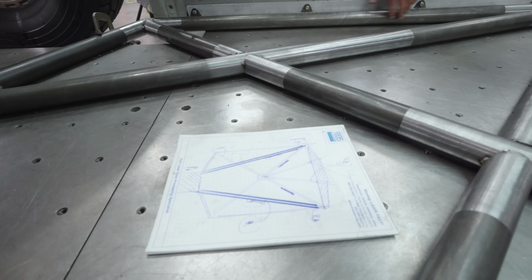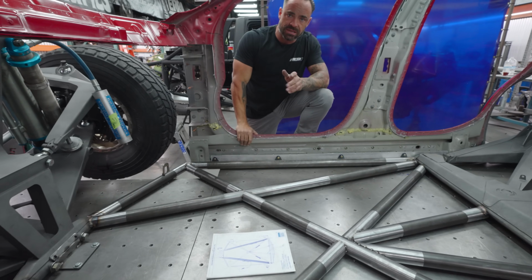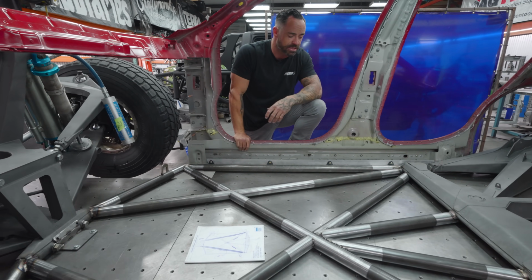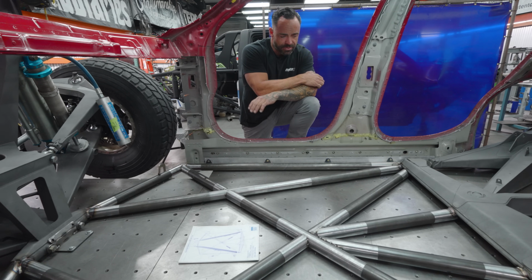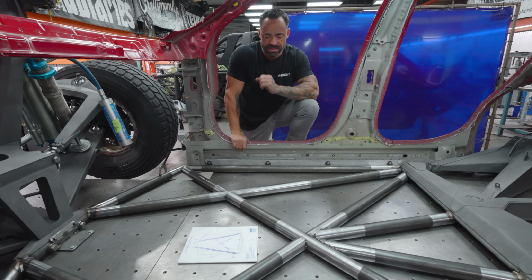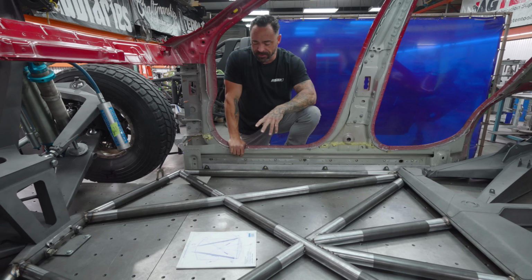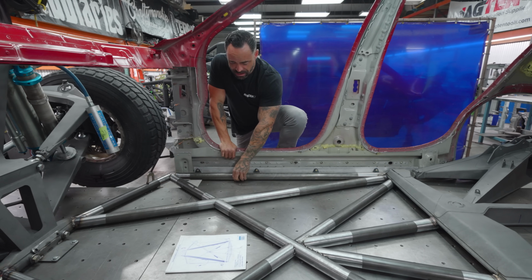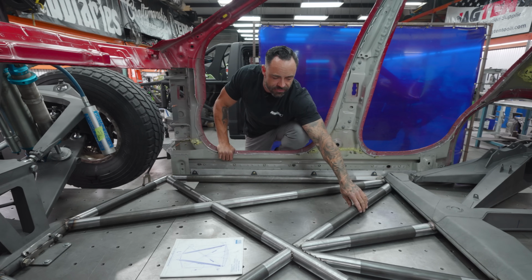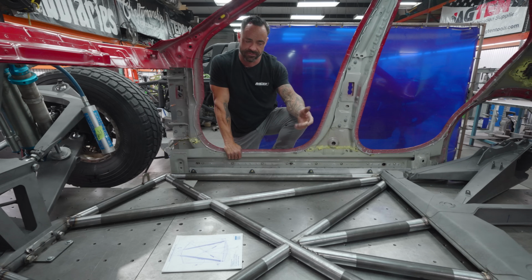The perimeter here, what I want to talk about with this is wall thickness. Just like Vivian, I like to use 2-inch tubing, 2-inch OD, outside diameter. And I think that it looks strong. It represents like a gnarly, rigid structure. But the wins you get is you apply different wall thickness into the tubing. And with that, the outer perimeter here is 120. This is 120, just your 1-2. And then your secondary X that goes through here is 095. And then these guys are 065. And you can kind of tell, that's 3 different hits, right?